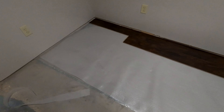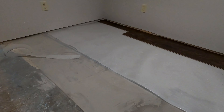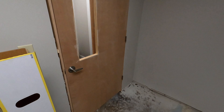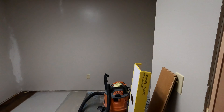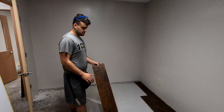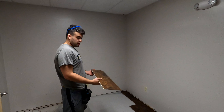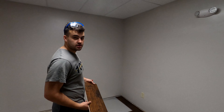It's the next day and the floor leveling worked out pretty well. We already started flooring — got the underlayment down and a couple rows going. We went ahead and installed the other door too. We're starting to run our planks — it's a pretty easy laminate floor, pretty wide, going down quick. We're just putting it in, taking our off-cuts, starting the new row, and basically have no waste.